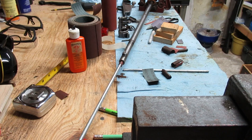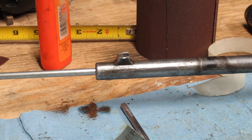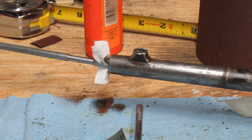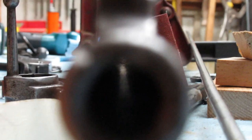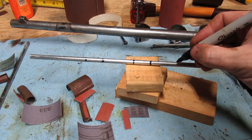Pushing the drill in I can feel more resistance in the area that I haven't worked yet, which shows that it's removing material little by little. You can hear the sound change as well — it gets higher pitched when it hits that spot, but after a few more passes with fresh pieces it goes away. I'll clean it up with a patch before taking another look. And that's looking much better. It's becoming more of a smoothbore and less pits and valleys like it was before, almost like the surface of Mars. I think I do need to go just a bit deeper since you can see the transition area back to the roughness.